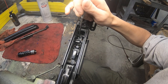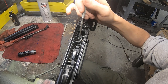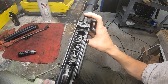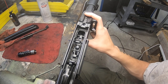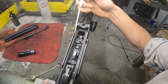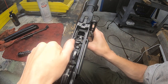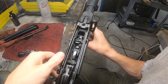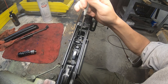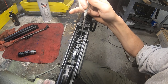But this trigger is hopelessly and horrendously complicated, and its sole purpose is to let the hammer go. It still does the same thing, but you can see with all the extra linkages and the up and down and back and forth — sanity should be questioned when people come up with designs like this. The safety still works like it does on a traditional AK — nothing fancy. So you get a worse trigger both in feel and in pull and in repeatability.